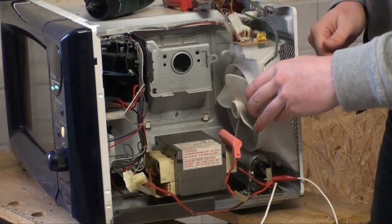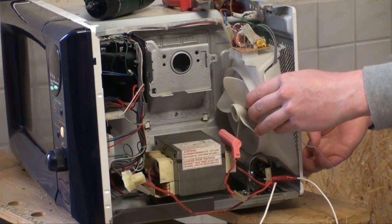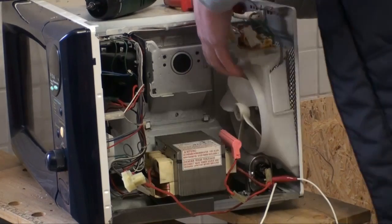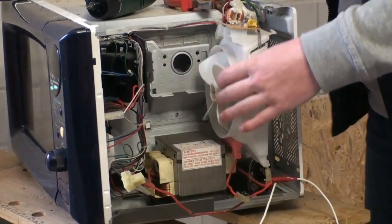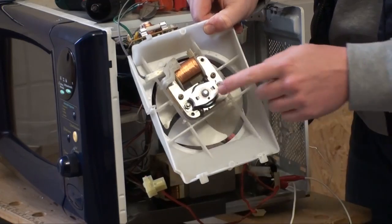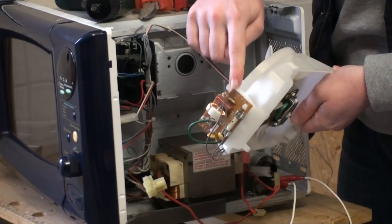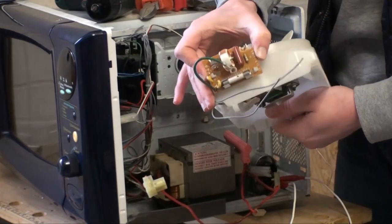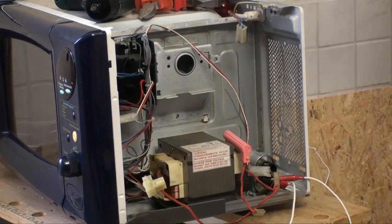As you can see, the whole entire ventilator fan part is just clipped in place. There it is — a filthy dirty ventilator fan, little shaded pole motor down there. And there is that mains filter choke and fuse thing. There is quite a hefty 16 amp fuse on there. That's quite interesting.